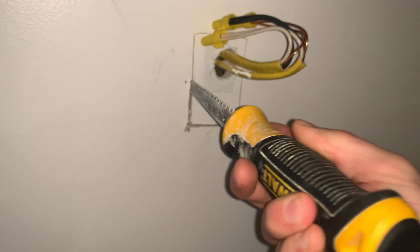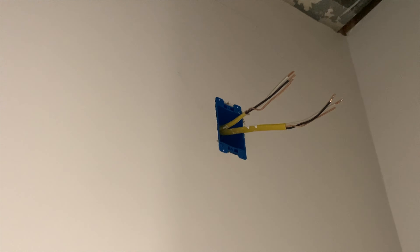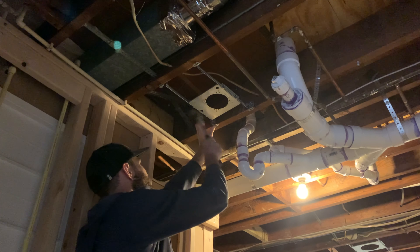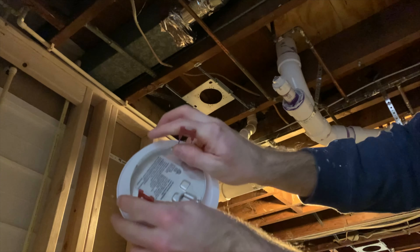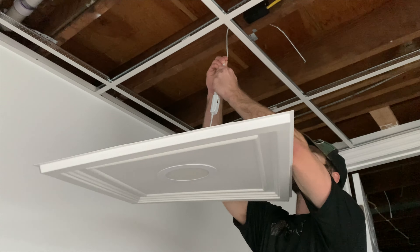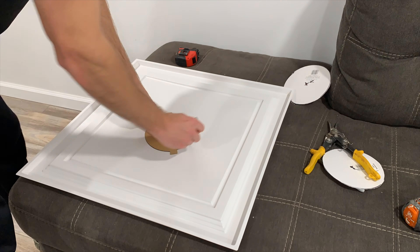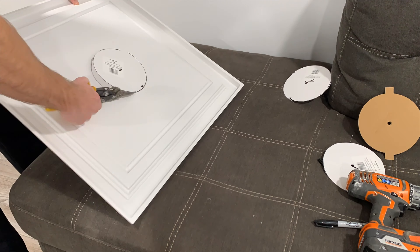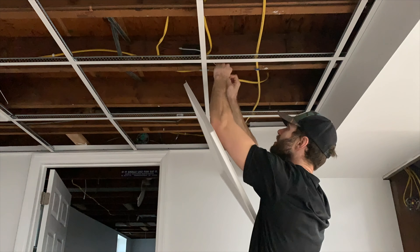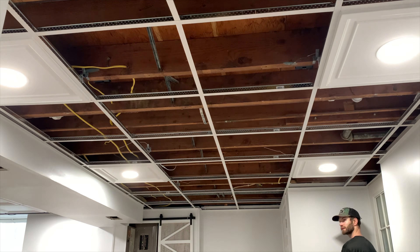Because my LED bathroom mirror was between two studs, I installed the drywall and then carefully cut out the gang box with a drywall saw. This electrical box is for existing construction — it has fins that mount directly in drywall. I then installed the LED mirror per the manufacturer's instructions. For drywall ceilings, install LED mounting frames: thread the wire, clip them in, and they hold the LED light flush. Since I used a drop ceiling, I cut the LED lights into the drop ceiling panels using snippers to the right diameter, wired up each light, and attached them to the panel. Here are four lights installed and tested.